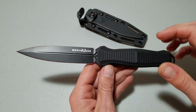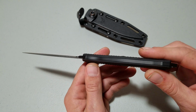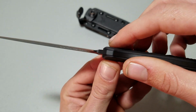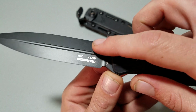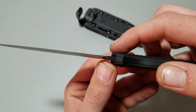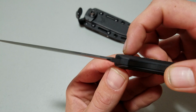The blade is a lot wider. The stock thickness on this thing they advertise as .144 inch, and I'm pretty sure that is the stock here, .144 inches. Because if you look at the way this blade is ground, the way that it's a dagger, it's ground on both sides. It's got a V grind on both sides of this blade, and so it actually tapers down right at the start, right at that plunge grind right there.